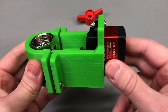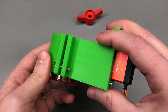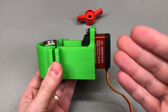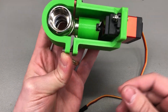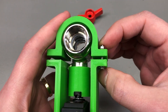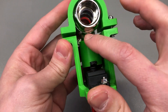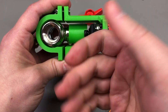I've been thinking about what happens if the servo fails and I need to manually close the valve. Right now there's no quick way to remove it — I'd have four screws to undo, which could take five minutes, and once the clamp is apart there's no knob to manually spin the valve. I want to redesign this to use just two screws on one side and add a built-in clamp mechanism so it doesn't need all four screws. I also want to add grooves or threads to the valve adapter piece so I could spin it by hand in an emergency.